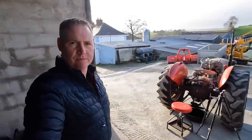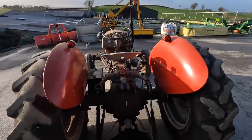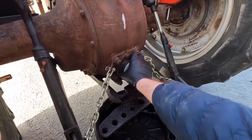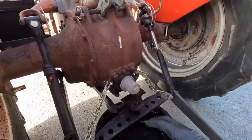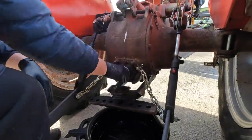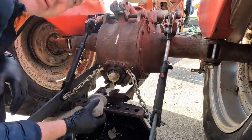We've been kicked out of the calving pen because calving season has officially started. The first part of this was filmed about two weeks ago - putting it all together bit by bit. The next job we're going to do is actually remove this PTO because there's a seal gone - it's leaking oil very badly at the minute. A very common thing, and it shouldn't be too hard to fix - there's a little seal in there. We just have to pop open these four studs, pull the whole thing out. I'm facing the tractor downhill so I don't have to drain the oil. You can see the oil running out of it - once I take off the cap, that's a sure sign the seal is gone.